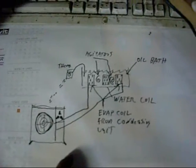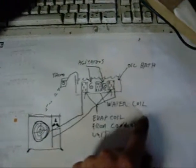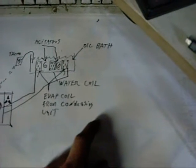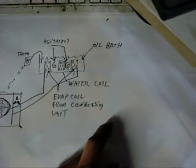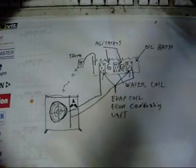From there, the water that comes out of the coil will go off to the mould in the injection moulding machine, and just cut the temperature down and decrease the cooling time for the parts — save a bit of time and make a bit of money basically.